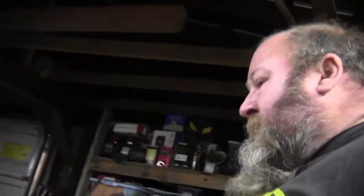I didn't get the opportunity to get any epoxy primer — I'm really interested in it although I've never used it, and it was hard to find. So I was just going to use an etch primer, then tape it off and not cover any areas on the inside of the rockers. I may do the bottom too with some of this hammered paint — that's some tough stuff.